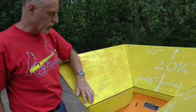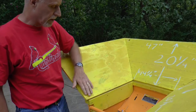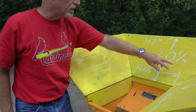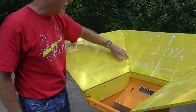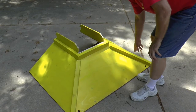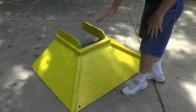When we get done, we're going to have screws all along this surface going into the 30-degree angle 2x4s, and then all the way up the two joints that tie the sheets together. They're going into a structural piece on the back, which is the spline that we mentioned. These are a couple of splines I made on the side, and I'll show you in a moment what that's like.